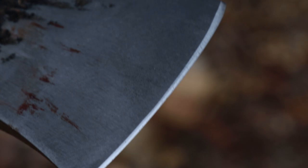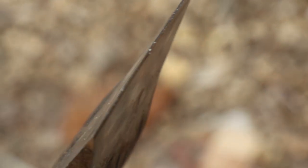I'll show you on the Brant Cochran, we're looking at more like a 22, maybe a 22 and a half degree bevel. And then right at the very tip, it sharpens down and in, giving it some serious sharpness right there, but a nice strong bit. That thing's just as sharp. I could shave with that or just do that and it'll stick in.